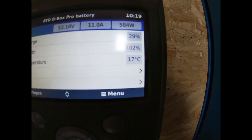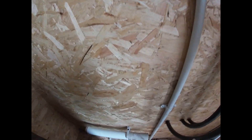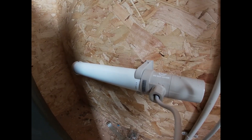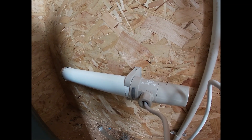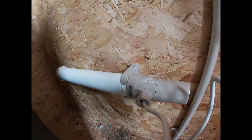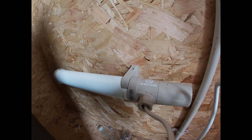I guess we're keeping the battery in really good condition by keeping it nice and warm. As you can see, it tells you the battery temperature — if you keep it in the optimal range the battery will work better. If you watched our video on building this shed, we've got insulation behind all these walls, and we've gone and plugged in a little bar heater down the side of the battery. It's got an adjustable thermostat so we can keep this room around 20 degrees; on a nice sunny day it probably gets about 22-23 degrees in here with the heat coming off the batteries.